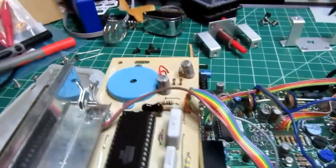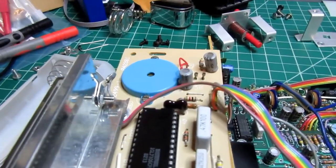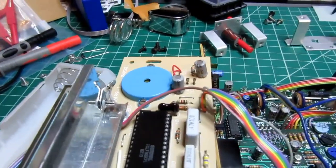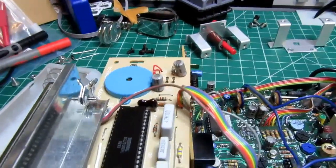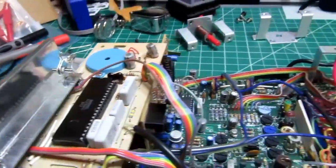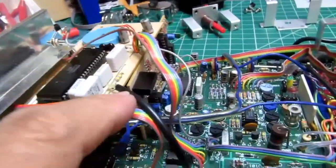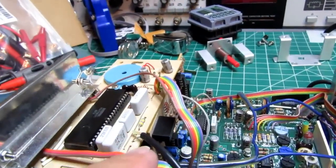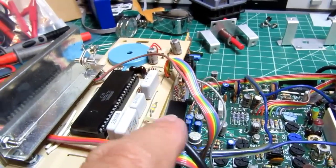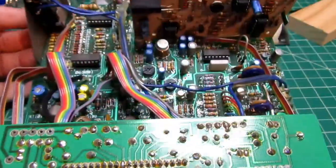Here is the piezoelectric element — the transducer. That is not a self-contained buzzer; if you just power it up it wouldn't make any sound. It only makes a beeping sound because electronics are driving it, much like a speaker — it needs to be driven by an audio signal. The board has one to two ribbon cables going to it, and also a shielded cable through which the actual signal being measured is supplied from the main board up to the display board.